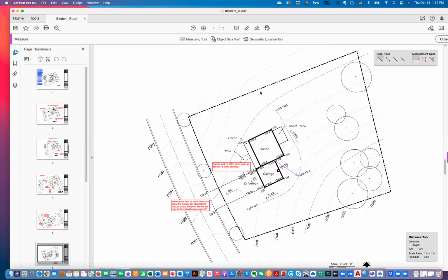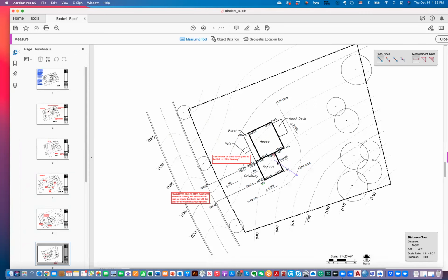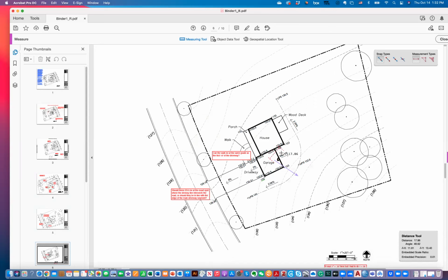So if I do 20, that seems like it would be two things. So it's probably 30. I would say it's slightly below 2%. That's my only concern with this drawing. And the deal with less than 2% slope is it doesn't drain. Yes, this area will be too flat. Okay, I will change that then.